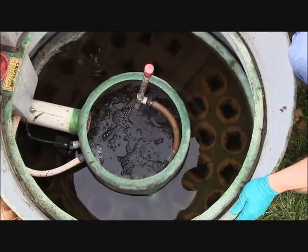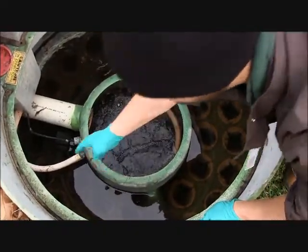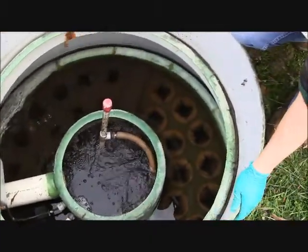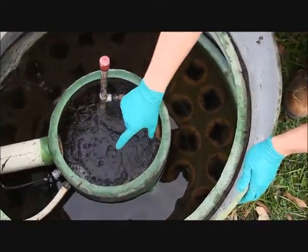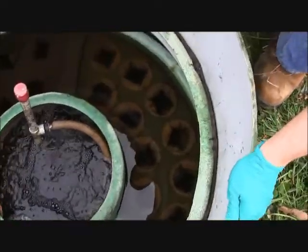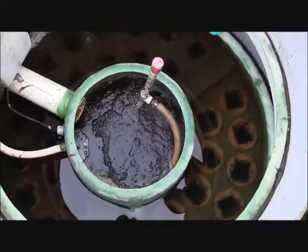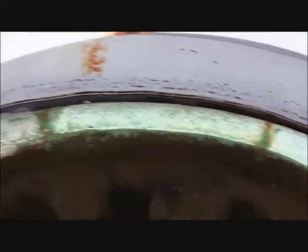Once aeration occurs and further treatment through the filter socks occurs, treated effluent moves up and onto the weir deck, again divided into three banks. Each bank contains 10 filter socks. We examine the filter socks to ensure that they are properly sealed and seated around the weir. We note here, by bubbling, that this particular sock is not as well seated as specified by the manufacturer. On the weir, we see clarified water, which is the final treated product that will be discharged from the multi-flow unit.